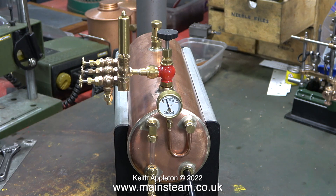I'm starting off by allowing 25 PSI into the boiler just to test all the connections, and everything seems to be fine — the whistle blows, the birds are singing, and the sun's come out. If you keep your eye on the pressure gauge you will see it start to rise as I pump more air into the boiler; I'm taking it up to 50 PSI.